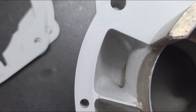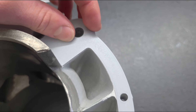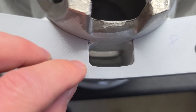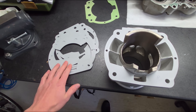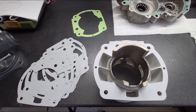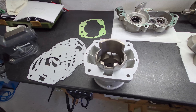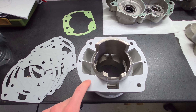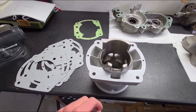My measured surface is definitely more precise than the original gasket. It is absolutely spot on in every detail, and also the radius of every corner is absolutely perfect. It took a lot of time, but it was worth it because I want my engine to be as precise as possible. The goal is that in 10, 20, or 30 years I still want to think I am not able to build this engine better than now. I have this surface as perfect as it can ever be.